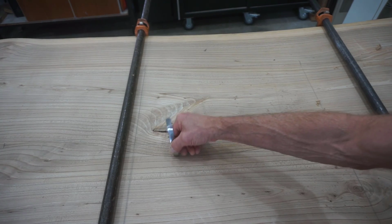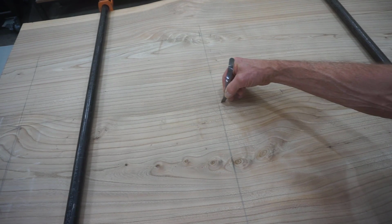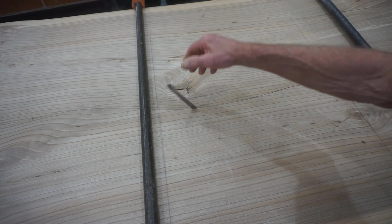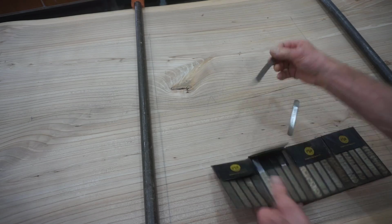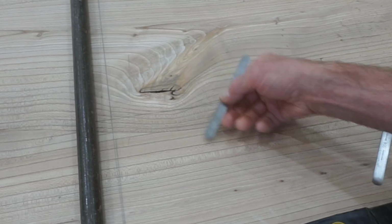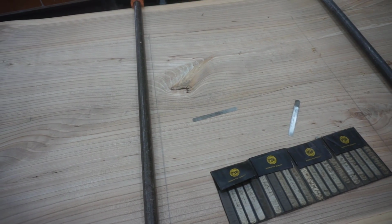There's a little bit more there. That's 4/1000ths. Most of this I got nothing. There's a spot there that 4/1000th falls right in. I'm going to jump up to 6/1000ths and see. Yep, I'm afraid I got a 6/1000th of an inch gap in there right by the baboon nose. What do you think? Should we glue it or try again?